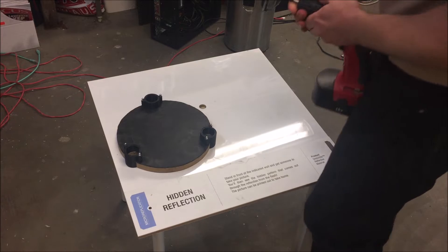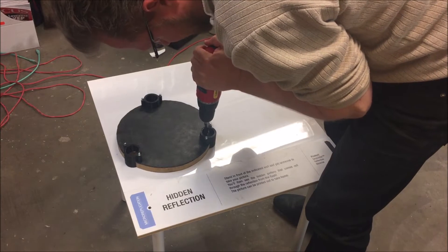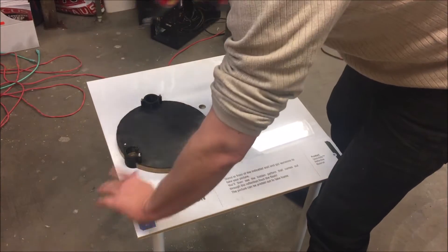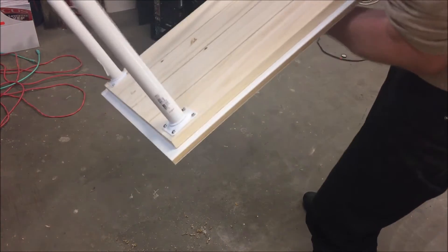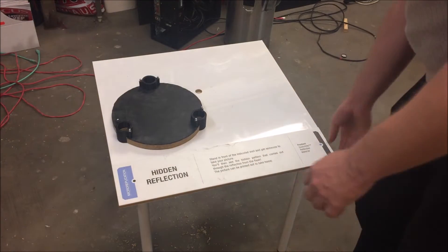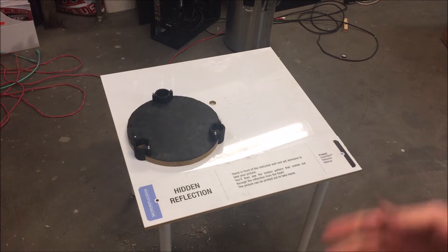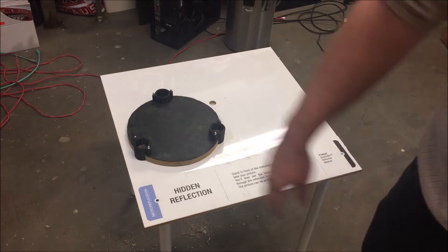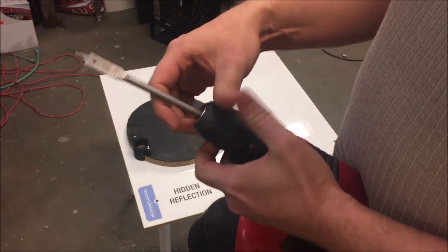I'm going to start by drilling that hole — taking an 8mm drill bit. I didn't sink it all the way through because I need to add the pipes as well, and now I don't have enough leeway for the pipe to go through. That's fine — I'm just going to use another dimension on the threaded rod instead. Now to drill the hole for the cold cathode light.